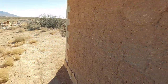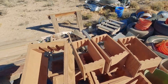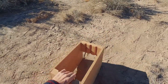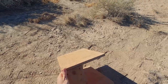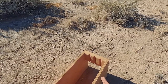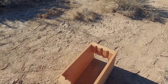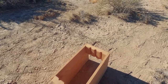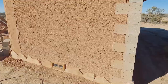You can kind of see the forms of the bricks still here — they make these T-blocks. I'll show you the forms I use. This is the boneyard for the build, so these are my in situ adobe forms. This form, if it were just a flat rectangle all the way around, could be a regular adobe form. But all you really do is extend the sides of the form down so they lap over the previous course, where there's a gap in between the blocks underneath.